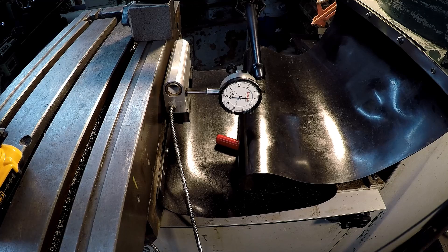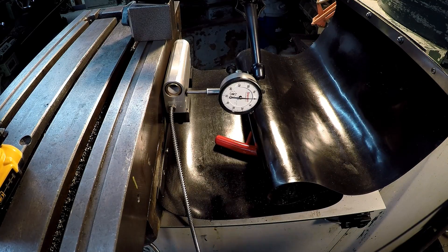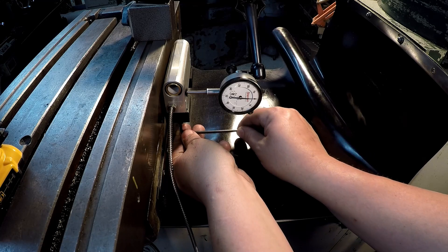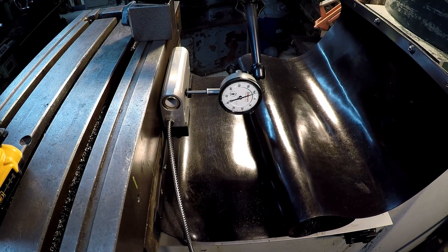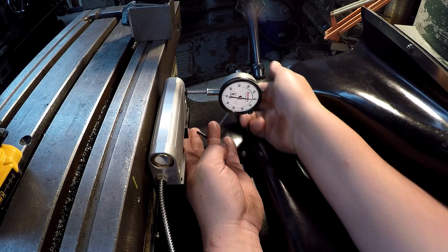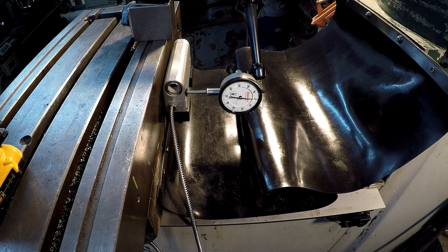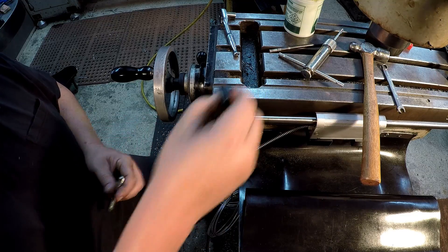I swear I didn't indicate that — it's just bolted in. I snugged them because I felt like they were pretty square against the hole. Okay, we're getting closer. Reader's mounted. Now we need to work on the scales. Move the table all the way down closest to the cable side of the reader, and I'm going to transfer punch to drill and tap for these just like we did on this side.